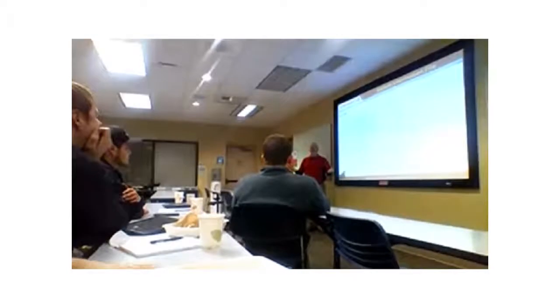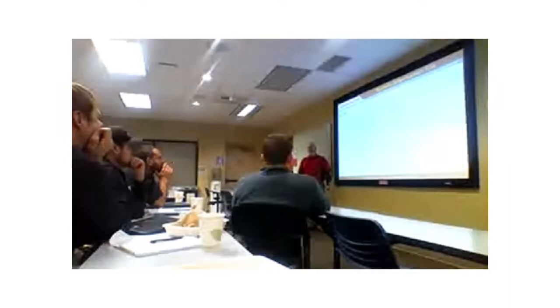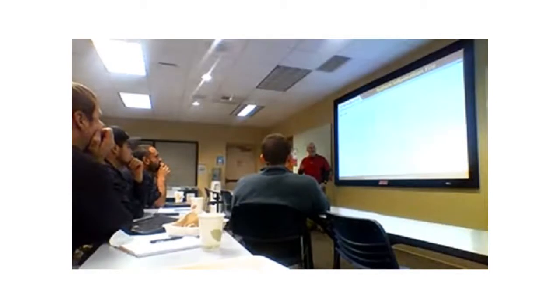Sometimes that's good. I'm reviewing a job that had 500 units in it. Finally finished the startup after 6 weeks on a Thursday. On Friday, I emailed the project manager and I said, there's 2 units on the 42nd floor. The BTU sizing doesn't match the DSP. Either you installed the units in the wrong apartments, or the dip switch is set wrong on the indoor unit.